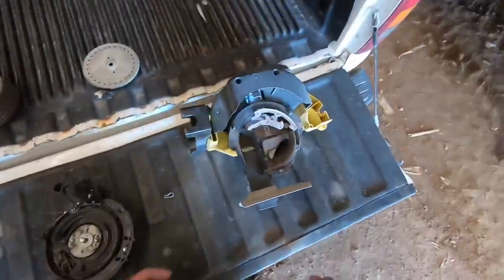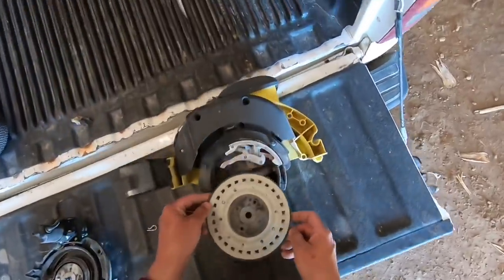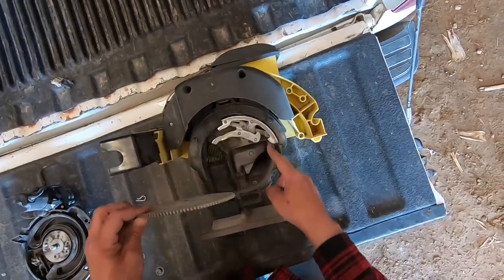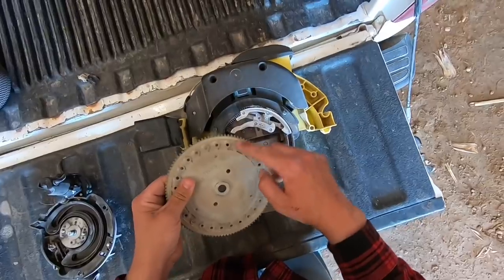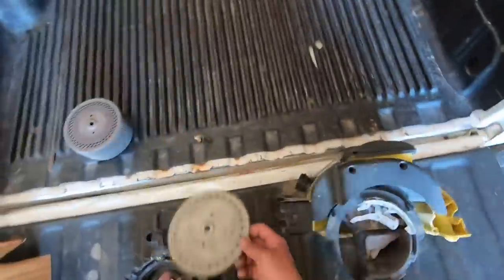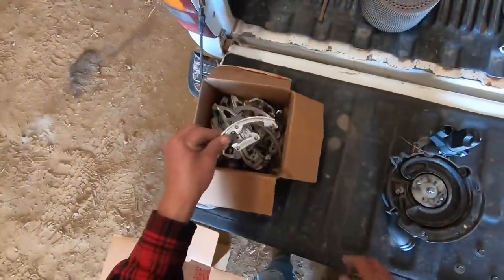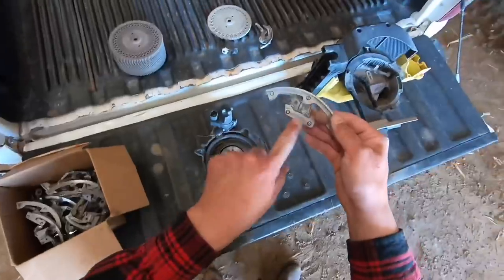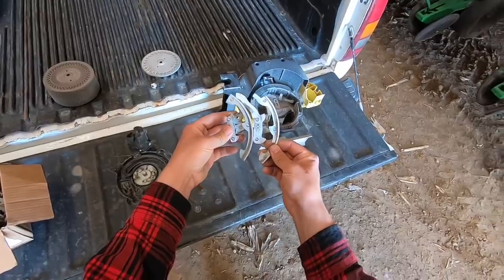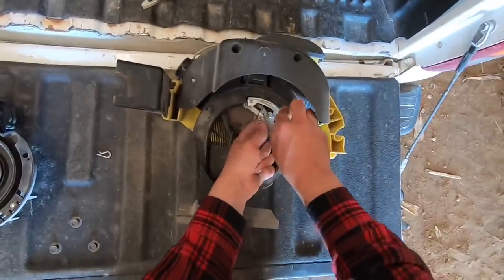There, that's in. And then the singulator, if you remember from one of the other videos, the seed is on the disc spinning like this, and it goes past all of those little teeth on the singulator, and that jostles the seeds back and forth on the hole. And if there's more than one seed stuck to a hole, it'll knock one of the seeds off. So we have to take the corn singulator off and just pop it right out of the clip. And then here's the soybean singulator. It says soybeans right on it. And there's the difference. I can't see a whole lot of difference. It looks like it's a little wider path for them to get through. Pop that soybean singulator on.